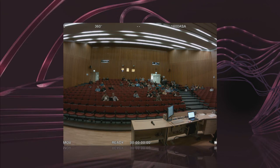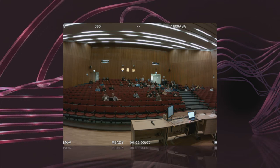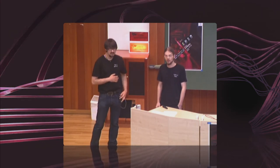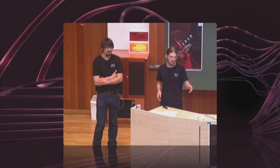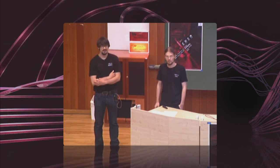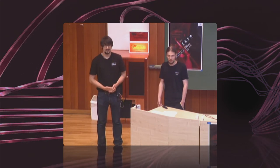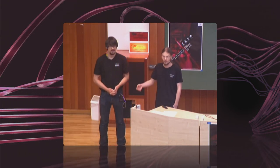You mentioned the microcontroller had something called DMA. Could you explain what that is? DMA is called direct memory access. And it's basically exactly that. Some hardware peripheral has direct memory access. You write something in the memory, say, hey, SPI engine, there's your starting point. Please feel free to write out anything you find there. Say when you're ready, or done. And that frees up a lot of computing power and saves you timing issues because of interrupts or whatever.